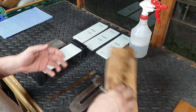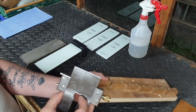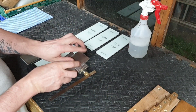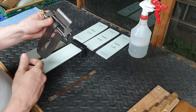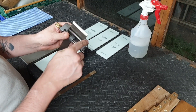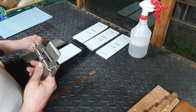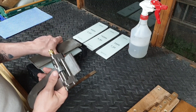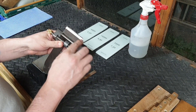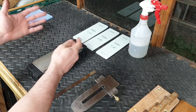Welcome back. We've established the depth stop for 35 degrees with the honing guide. Generally some of these steps I do miss in sharpening — it really depends on how much the edge degrades. I'd recommend if you can see your secondary bevel is quite large, such as this one, run through all the steps. If you're going to a 2000, I would rather go to a 1000 first. Some steps can be missed if you have a tiny secondary bevel.